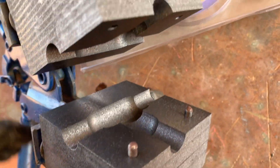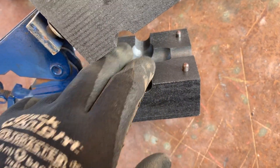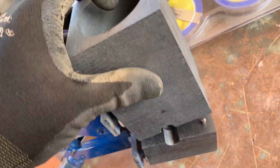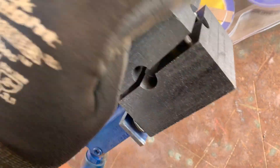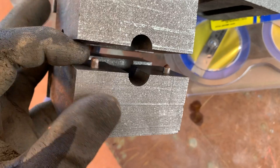This mould here is just for a T-piece join — one continuous earth joining up to one earth, or three earths joining up to each other. It's really easy to see the path that the thermite takes as it goes down, how it ends up, and how the mould takes form. These holes you can block with putty, or the cable just does it itself.